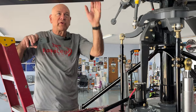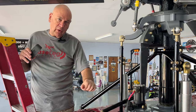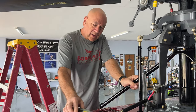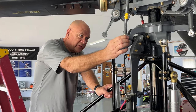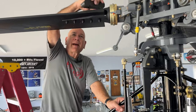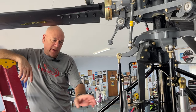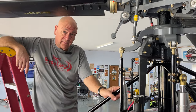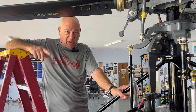And then there are multiple measurements to do on the blades, aligned to the left on the helicopter and aligned to the tail. So we're checking that we have enough control both with the collective and then with full aft and forward stick and left and right stick. It's a constant going back and forth. And the way you adjust the blade angle, if you look right in here, as the pitch link comes down into these rod end bearings, there are little washers in there that you shim it with. We'll put the protractor on top of the blade, with the blade aligned to the left, and then the blade aligned straight down to the tail rotor to take measurements. So we've got all or a little more than what the book specifies as required range of motion. I'm feeling pretty good about all that. If it feels good today, maybe I'll go around the pattern.